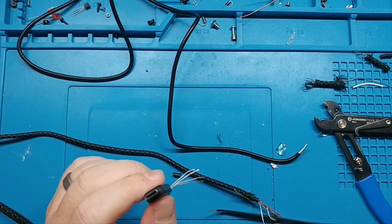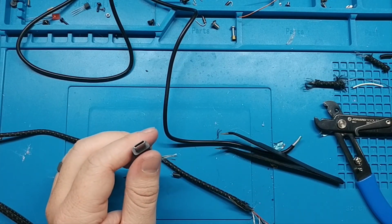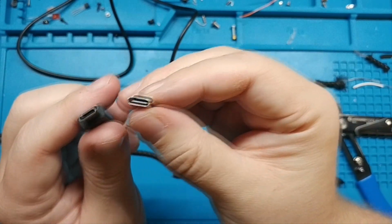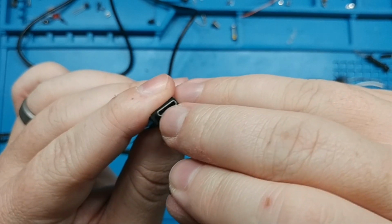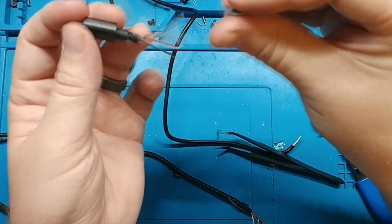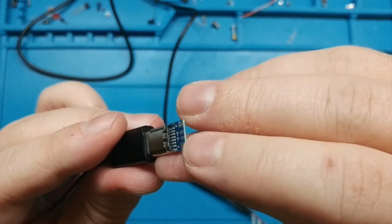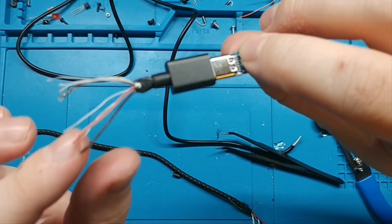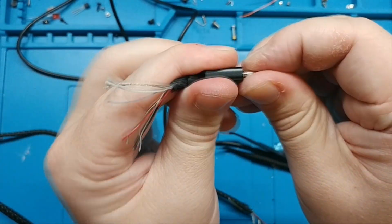And usually USB's correct. I haven't really run into any USB cables that use weird wiring colors. I'm sure someone has. But without something like these breakout boards that I have, it's going to be really hard, because the idea would be that you touch a specific pin, touch another end with your multimeter. If it beeps or if the resistance is 0, then you're connected. But good luck touching any pins in there. So you would have to get one of these breakout boards, and then those are the 4 wires that we need. And we would just touch one end here and one end to the cable and confirm that. But again, we don't have these in our scenario.